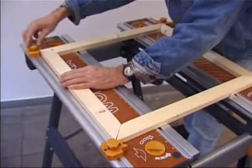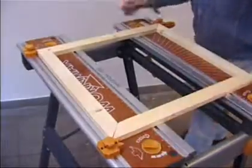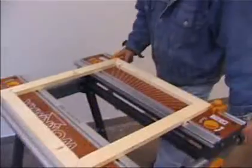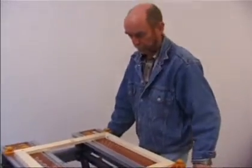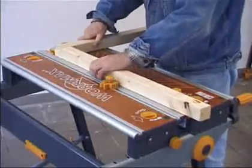Here for example we see the special L-shaped form of the clamping blocks adjusted to hold a mitered assembly. It would be impossible to do this sort of work on standard jaws. The blocks may also be used for layout, precisely holding the jointed wood pieces in a square position for drilling.